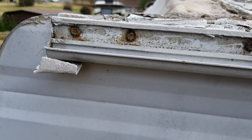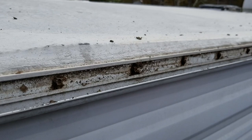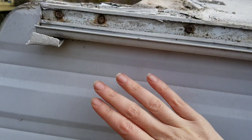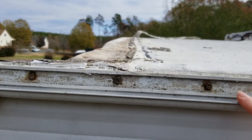Here's another quick heads up — this is up on the roof here. This is the gutter system that runs along the length. For these older units, if you have to take this off, what we found is that the stripping that runs along through here and covers the screws was very brittle. You have to take that out so you can get to these screws if you have to peel this roof covering up or take this panel off. So just be prepared with the older unit to have to replace the weather stripping that goes over the top of this, because ours just crumbled and fell apart.